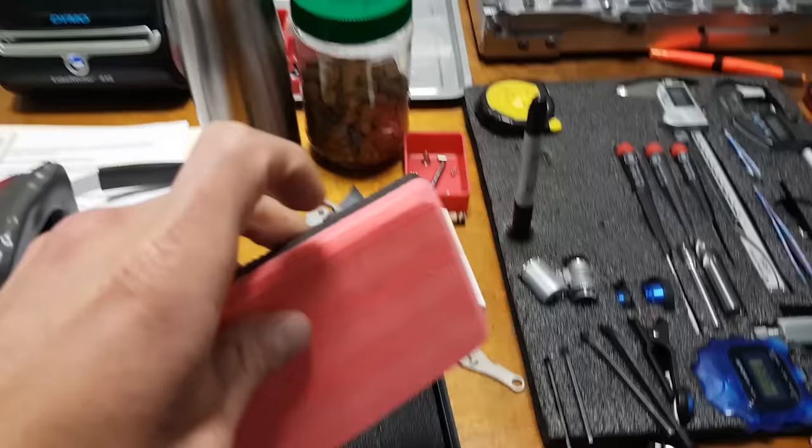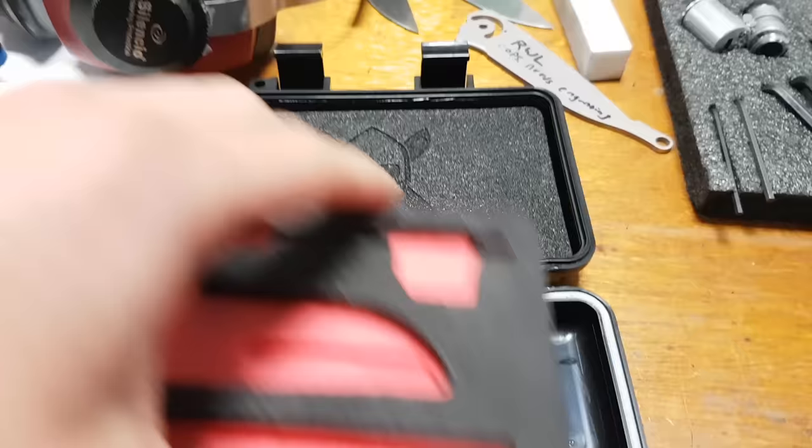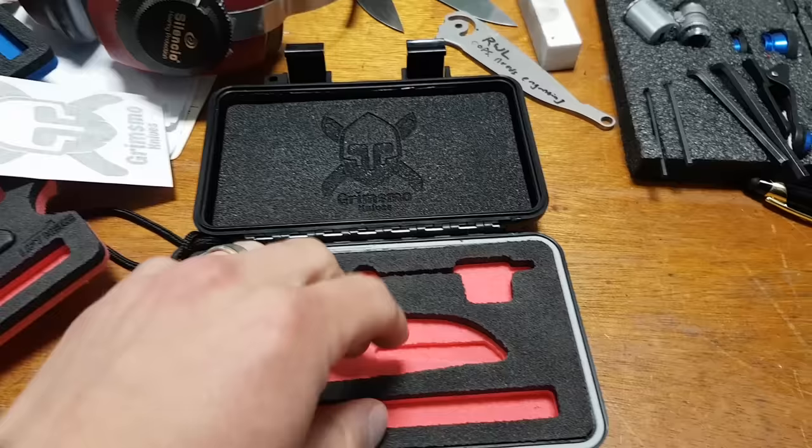Half of the reason is to get rid of that burr. The other half — see how we have a pretty large chamfer on here — it's because the inside of the case is actually radiused. We found that without a big chamfer, the case is not sitting flat; it's actually compressing in the middle and it's just not great.